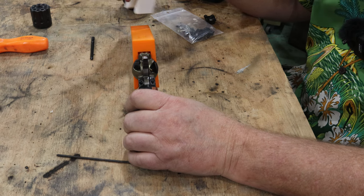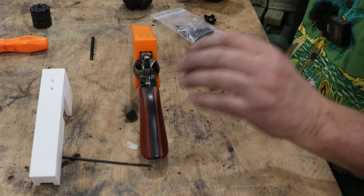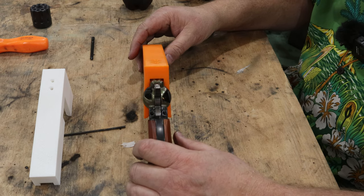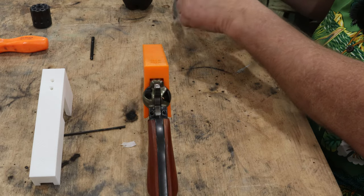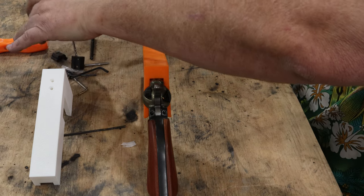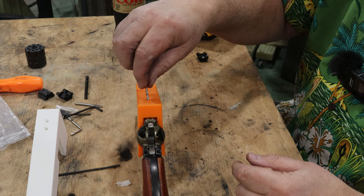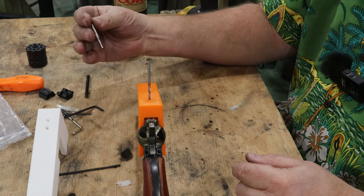Because I also have another fixture I made right here that's gonna help us out for the second part of this operation. So now, just like that, I'm gonna drill this by hand with my DeWalt drill. And in this little bag here, and I'll leave all the links in the description below for all the pieces you need to buy to do this, I have a number 31 drill. That's going to be my tap drill for my tap. Then I also have a 6-48 tap.